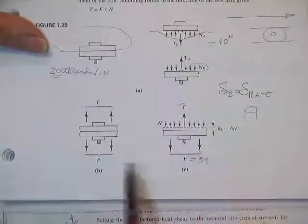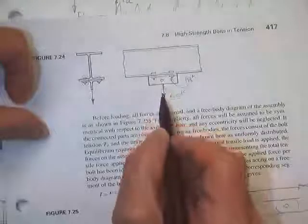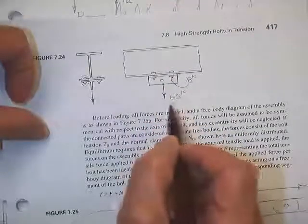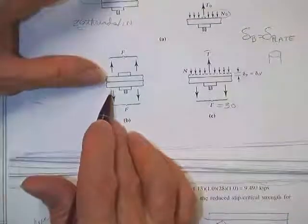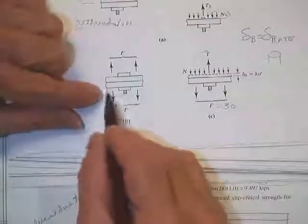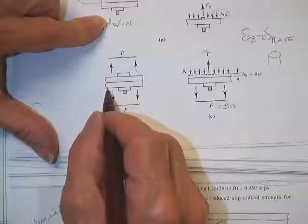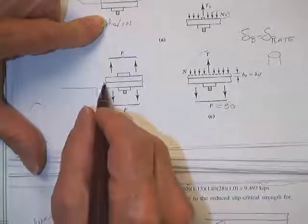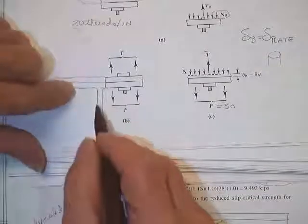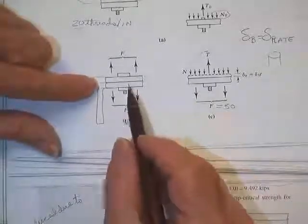If I draw a free body, somebody has decided they're going to pull on the plate — that's why you put the bolts in there and the hanger bracket, of course, with some force. When you do that, you're tending to open up these two plates. The load goes on down; this was a T-shape, here's the top plate — but somehow you're pulling these two plates apart around these bolts.